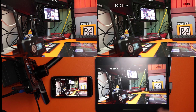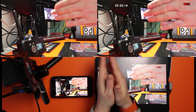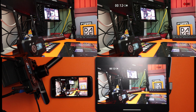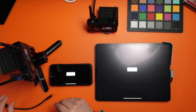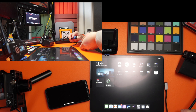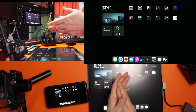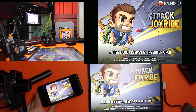On the top left we have the Canon recording directly; on the top right it's the actual receiver going into my Blackmagic 12G — that is where you'll see the latency. At the bottom you see my overhead recording the smart devices. I found the latency is around two to three frames, which I think is excellent, and it matches the stated specs. Because this works with any HDMI or SDI out, I'm going to run my iPad into the transmitter with the iPhone running the app, so you can see the latency in a little game — it's really, really good.